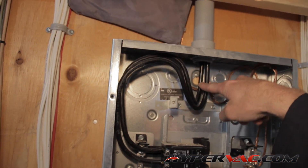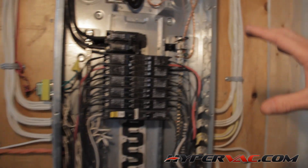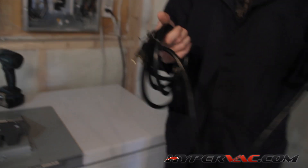There are two separate phases of power coming into the breaker panel. The house is powered off those two lines — some of the house will run off one of the phases and other parts of the house will be run off the other phase. So basically we need to find two separate plugs that run off each of the two different phases.